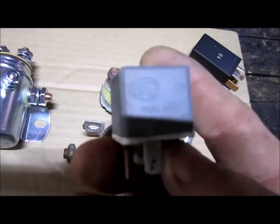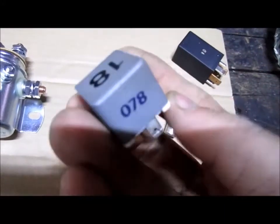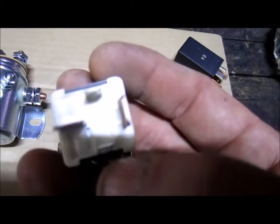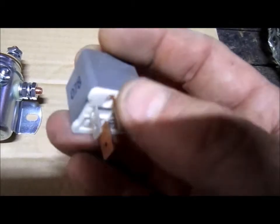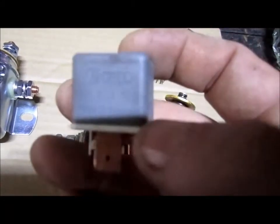This piece is basically the key of the solenoid — it allows the contact to be open or closed. A little relay like these works similarly the same. These are normally open, and when you apply power — 12 or 24 volts depending — to these two small leads, that engages the coil to magnetize it, which closes the little contact inside to allow current to travel through from one post to the other.